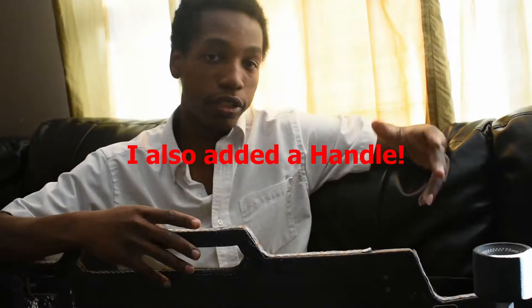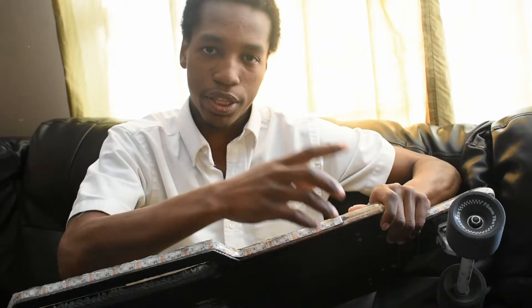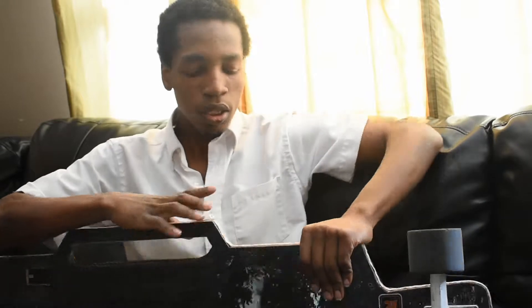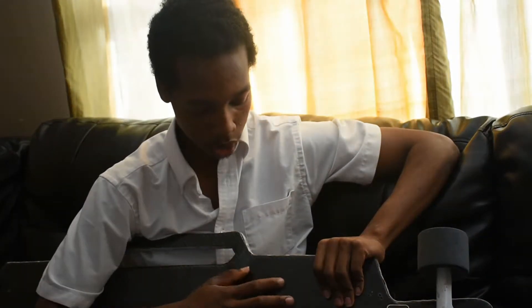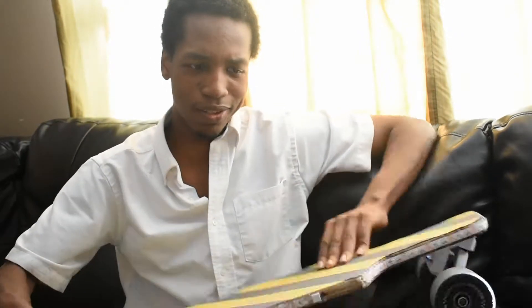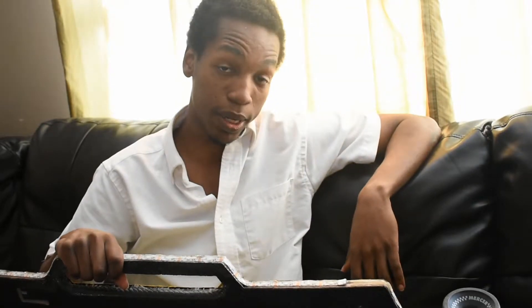This is what I ended up with. As you can see from that part, I originally started off with a longboard deck that I made with three-quarter-inch thick pieces of plywood that I got from Home Depot. I literally just laminated it together with some regular wood glue. But in order to get it a little stiffer, I decided to cover the bottom part with carbon fiber. I did the same thing with the top part, and then I added some grip tape on top as well so I can actually stick onto this thing — because at first it didn't have any grip tape, which added to the danger factor since I was able to fall off at speed.